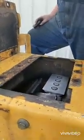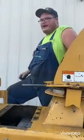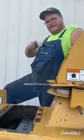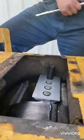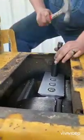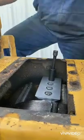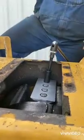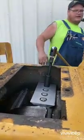Every one of the chippers that I've changed them on, the 1000, the Raycos, the bigger Vermeer like the 1500 and the 1800, the bolt lengths are different, but most of the time they're all 15/16 socket head. Make sure that goes all the way down in there, because if you don't, it slips off. I've done it before. You smash your hand on something and cut it. It hurts pretty bad. I bet it does.